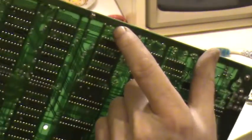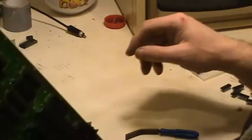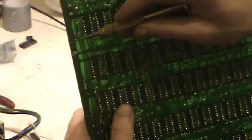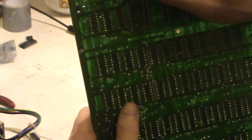This is the 5 volts coming down here, and through a via, oh no, through that capacitor. Through this little capacitor. Yeah! Give me a pointing device. My 5 volt to ground short was coming down this trace. Yeah, here we are. Coming down this trace, it went through this capacitor from here onto here.